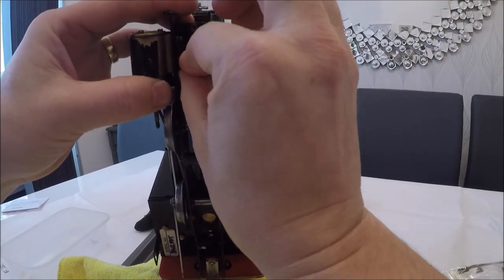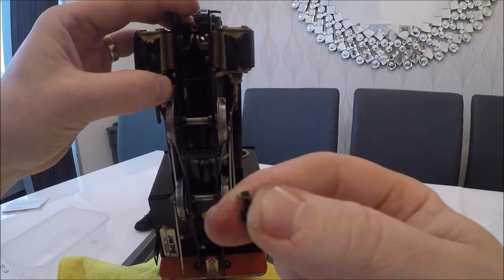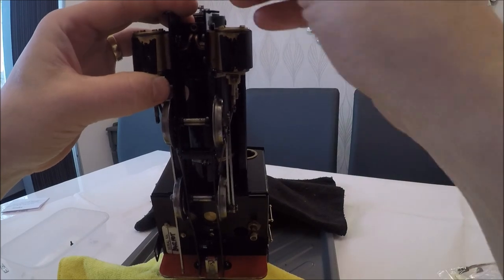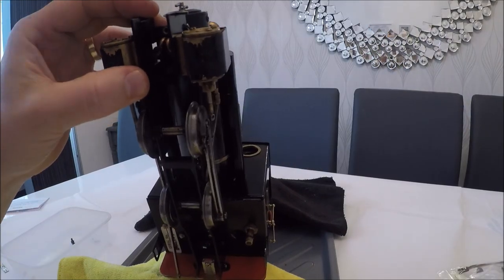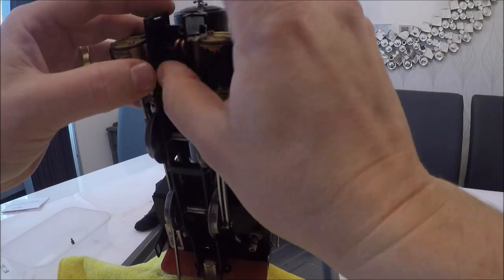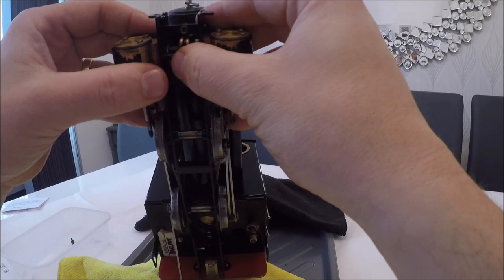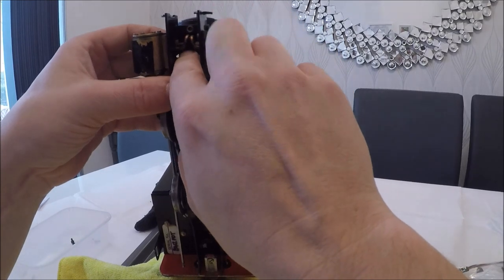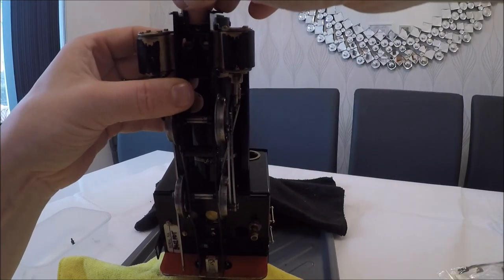Just note there's a little locking spring washer on there as well, so just be mindful not to lose those locking washers. There's the two from one cylinder — it won't be ready to come off just yet as we've got the exhaust pipe still attached to the back; they are threaded onto the cylinders. There are connections here we need to just loosen off.